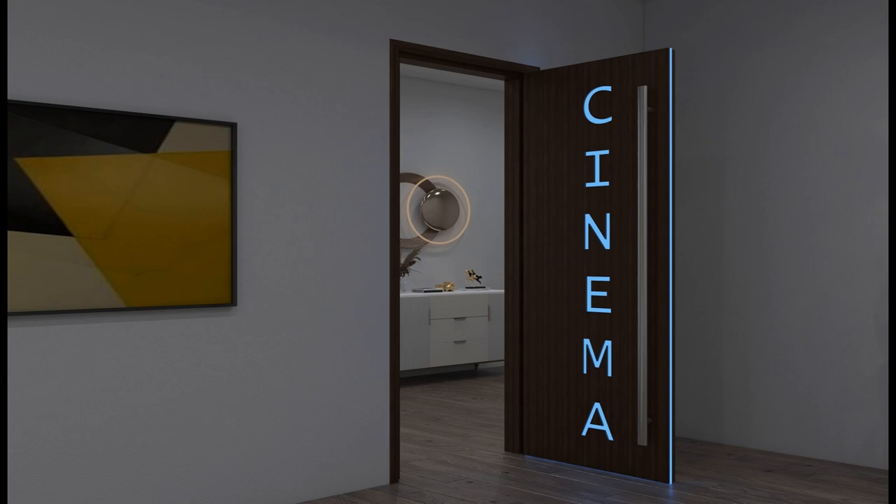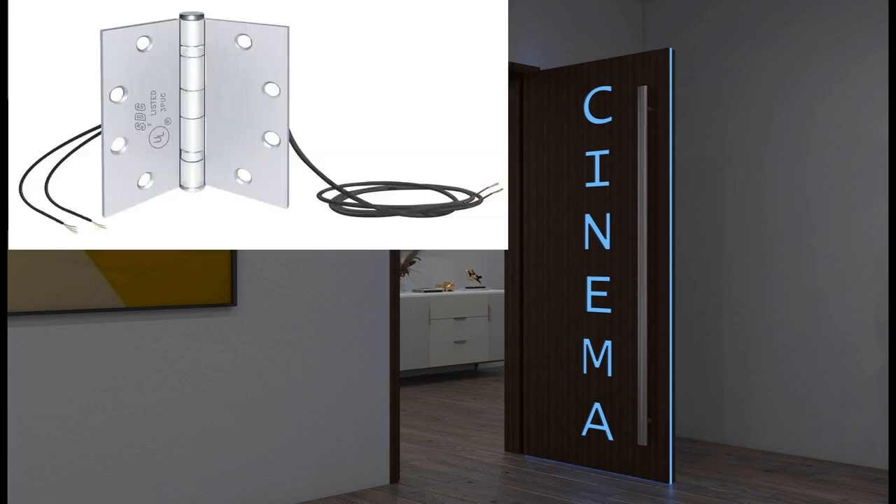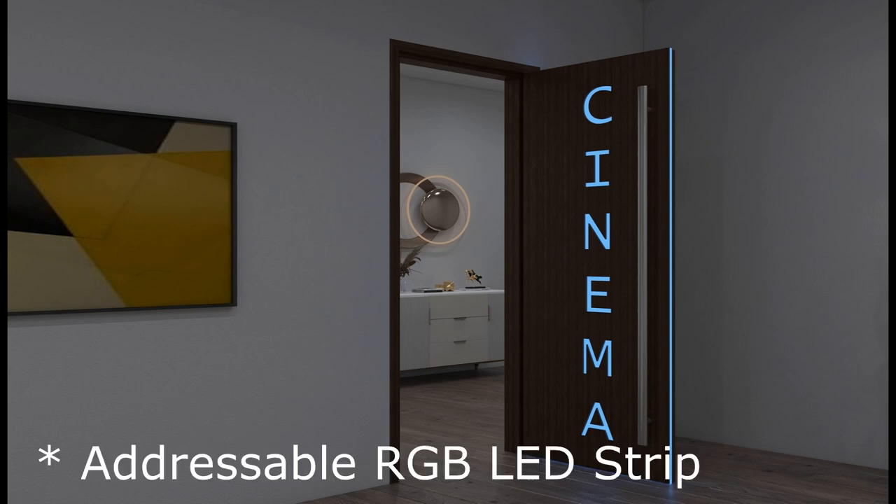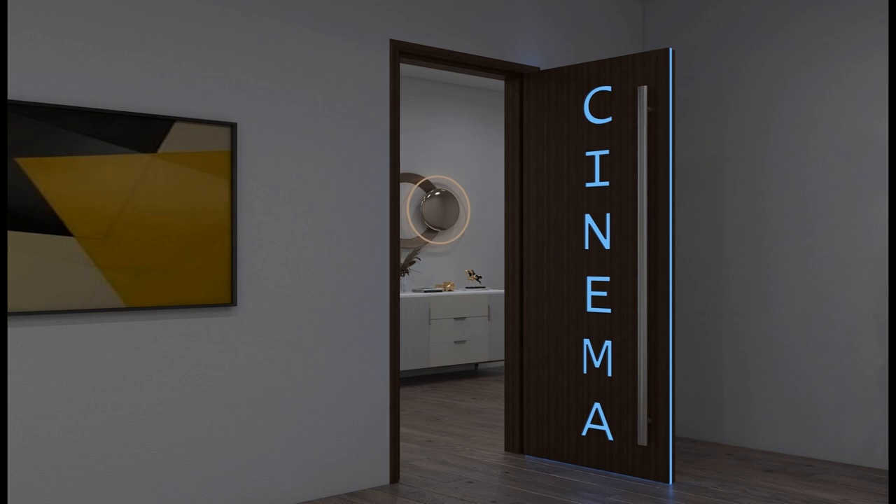Only one of the room doors is going to have the cinema sign lit up. A few people have been asking how we're going to light this. We're going to use RGBW lighting and will need to share pins using a power transfer hinge with a minimum of eight wires so we can double up the leads. We're probably going to go with a DMX 512 setup, because RGBW takes five wires total, but DMX 512 gets it down to three — a data, ground, power arrangement.